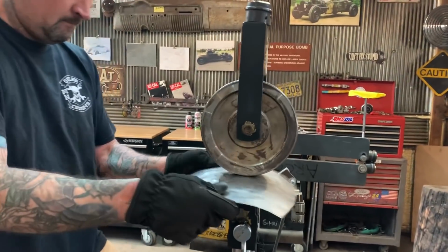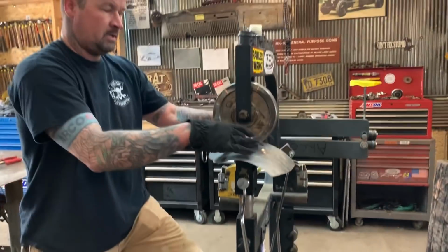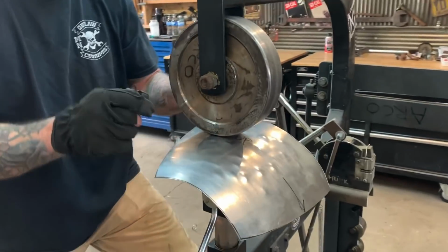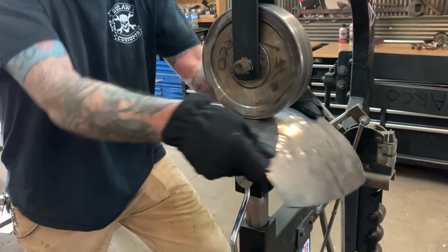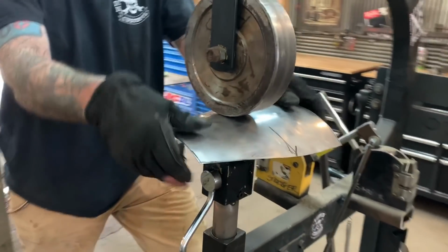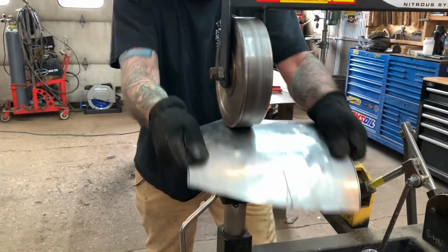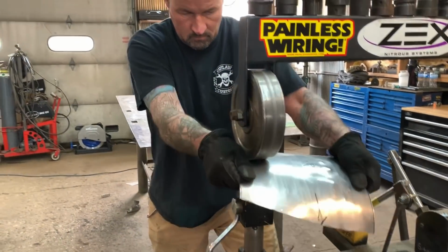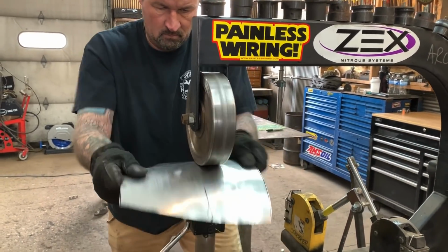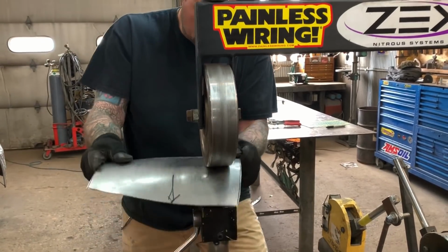You have to raise the center of it? Yeah, now I'm gonna raise the center of it, and I'm gonna tighten the English wheel a little bit, and you're gonna see me kind of work just the center area right here, instead of going all the way through like I was doing before. And I'm pushing down like this as I'm doing that, right here on both sides. There it goes. You can actually feel the panel starting to lift up a little bit.